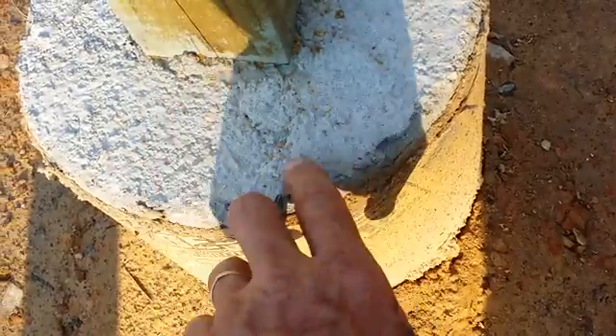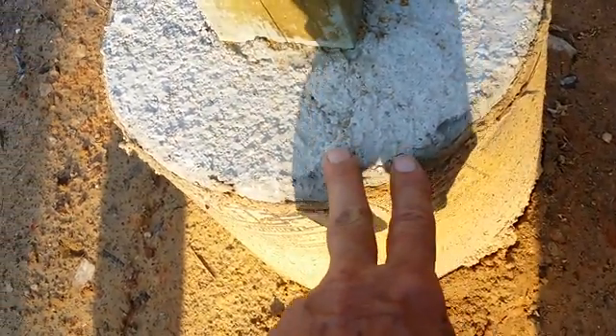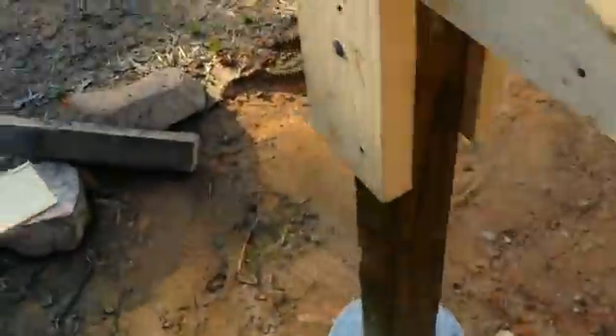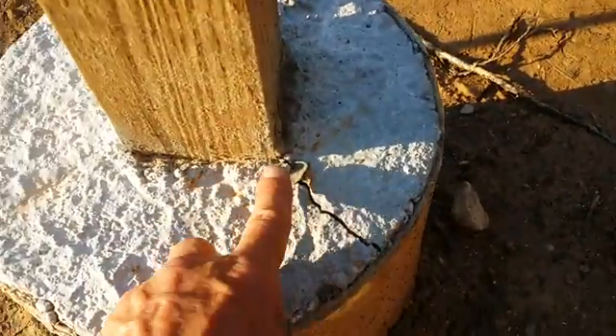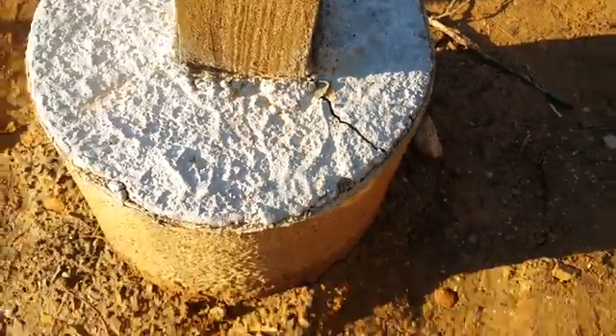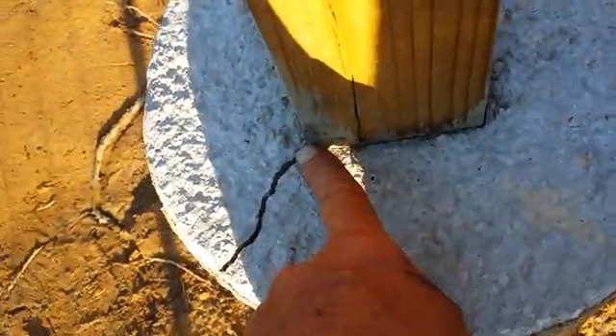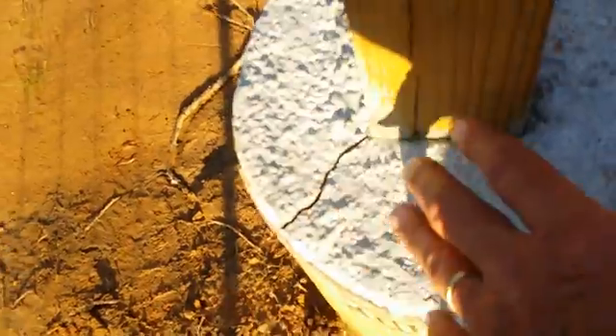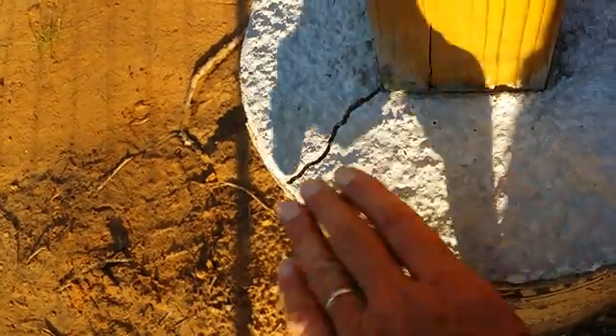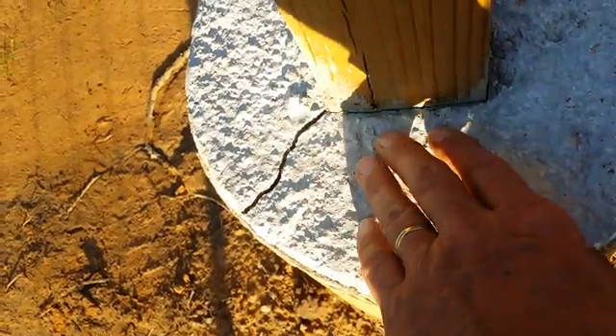As opposed to these Quikform ones here — this isn't cracked or anything — but if water gets down in here and absorbs into the concrete, it can expand and contract in freezing conditions and crack, which has already happened before I even put weight on my place. Here's a crack right here — it extends from here to here, I don't know how deep it goes. You can see the path of least resistance. If I hadn't used a tube at all and instead made a solid pier and put the post on top using a steel plate holder, that would have been the better approach.